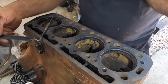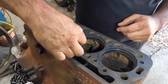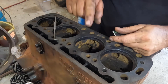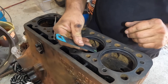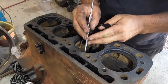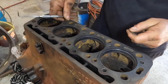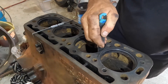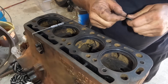These top ones are reasonably easy to clean. I've got an old power hacksaw blade that's been sharpened at the end, and I use that to run around and scrape any carbon off the ridge. We want to be very careful that we don't start taking metal off this ridge — if we use anything too abrasive, we'll start taking the metal down and that will change our protrusion on the top. I've also got a metal scriber to get right into the back corner and make sure I've cleaned all of that out, and I also want to run around the side lip and make sure that's all nice and clean.